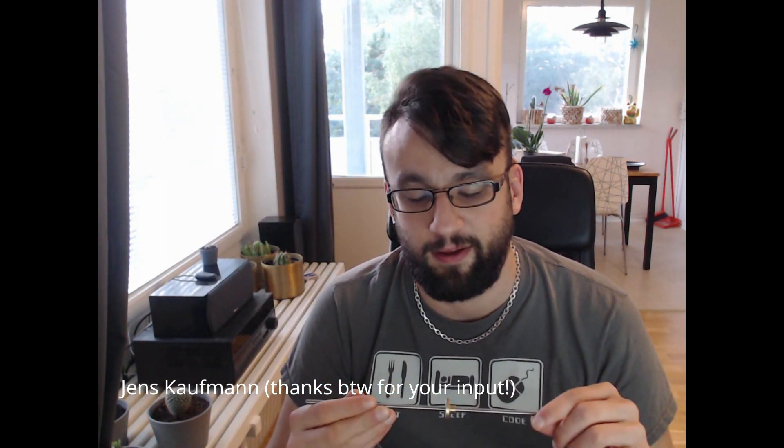I managed to get this piece with a little thing attached as well, and I thought it was perfect — same pitch, same diameter, everything. However, there is one big problem. As someone in the comments recommended, I should use what are called trapezoid threads, because they prevent movement under pressure. Well, this replacement screw is a trapezoid thread — but the motor is not. It doesn't go in.